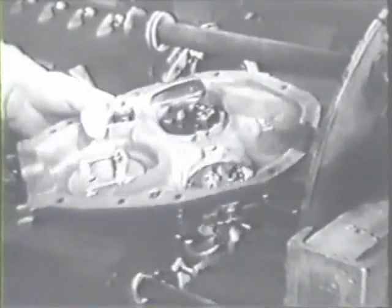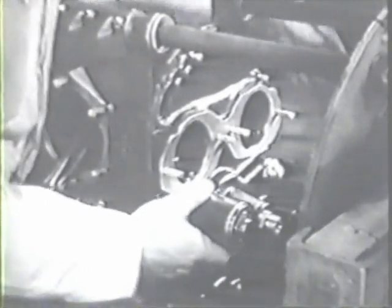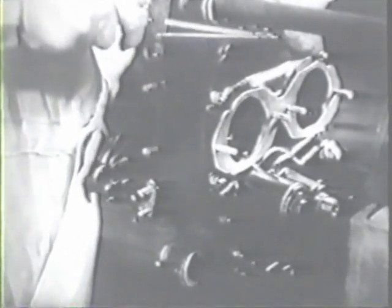Before you install the cover, give both gears a generous application of oil. Then put some oil into the oil pump to lubricate those gears, and fit the gear case cover on the studs and assemble the washers and nuts. Tighten the nuts evenly to the torque value given in the table of limits, and safety them with PAL nuts.